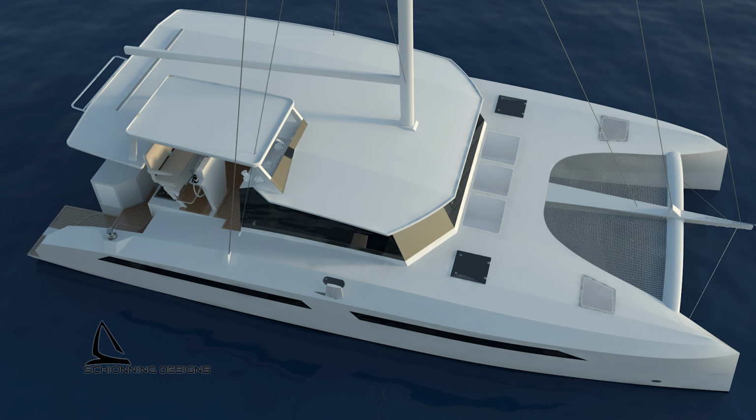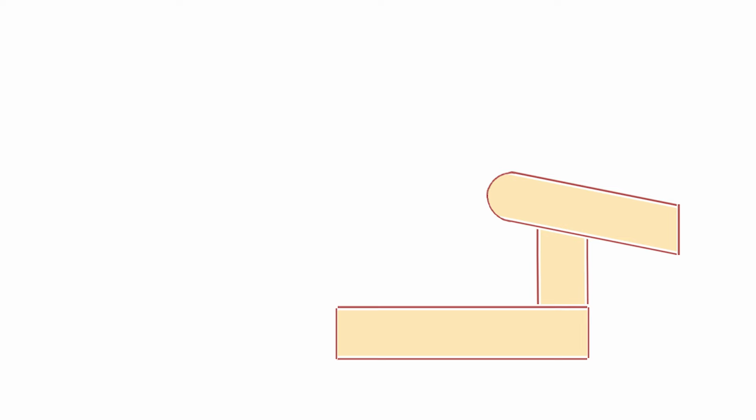To create this trough, we'll be cutting off a U-shaped section of the cabin roof out beyond where it meets the windows. Then we'll add 2 sections of foam to create the inset portion. We'll have access to round off these edges with a router and add a cove of thickened epoxy to this lower section right here, while it's still accessible, before reattachment of the cabin top.